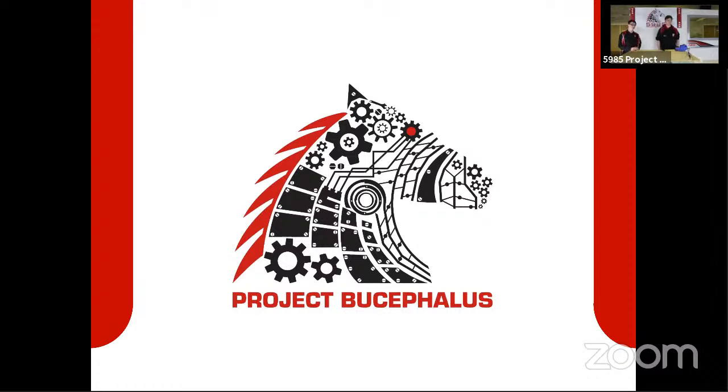Yeah. So something you should also always be mindful of is what kind of material the floor of your pit area is made out of. And if there are any restrictions on tool use put in place by the venue that you're currently in, you may need to go to a designated machine shop area to do work on components of your robot. And 90% of the time, you really should be using a shop vac or a protective cloth or a combination of the two to make sure you don't end up with metal shavings or polycarb dust or anything like that scattered all around your pit area and your neighbor's pits.